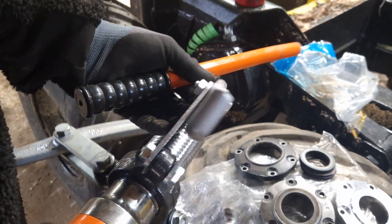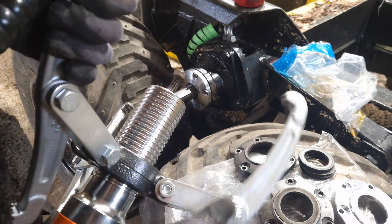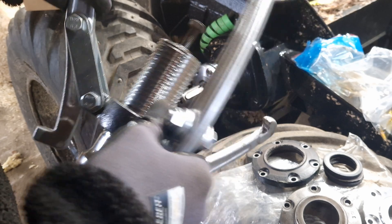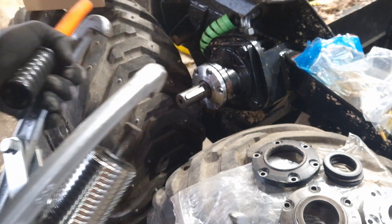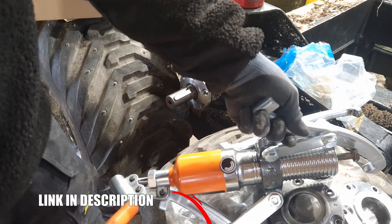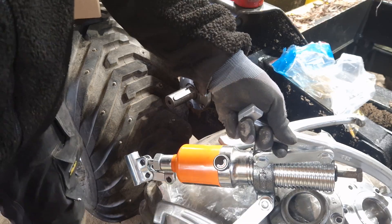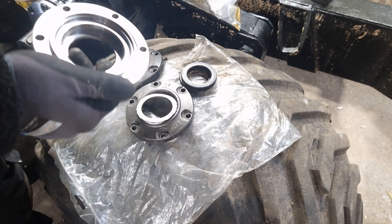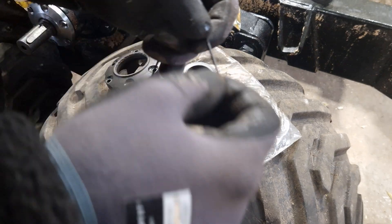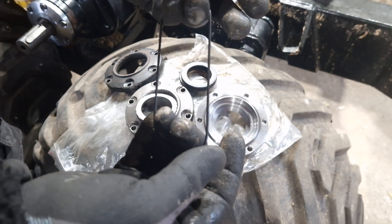I ordered this behemoth of a bearing puller — it's pretty big but it's hydraulic, very nice. The build quality is insanely good for the price I paid, I'm very impressed. You basically just hook it up, jack on this thing, and it pulls it right off. Unfortunately I didn't buy new o-rings — I should have done that — so we're just going to have to reuse the old ones because they're quite big and I don't have this size in my kit.